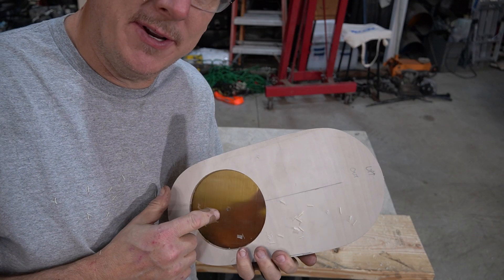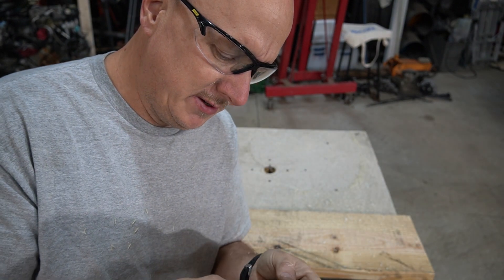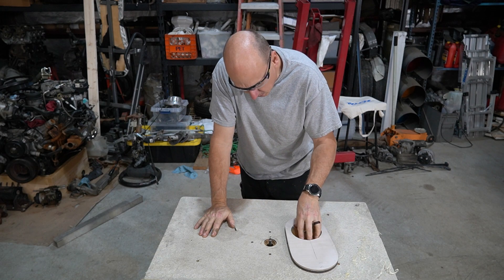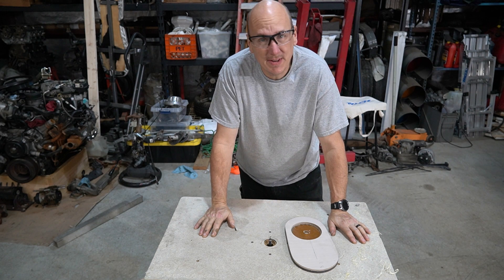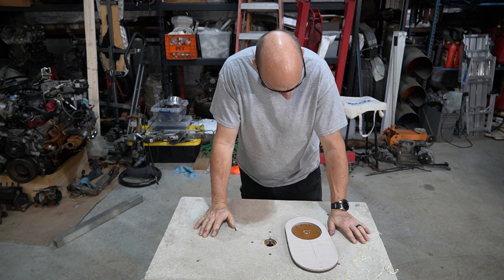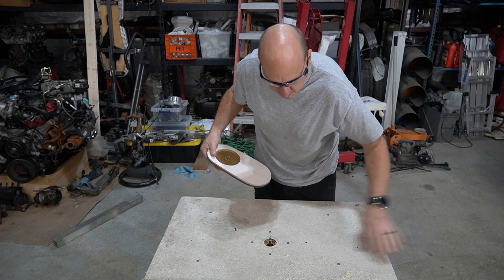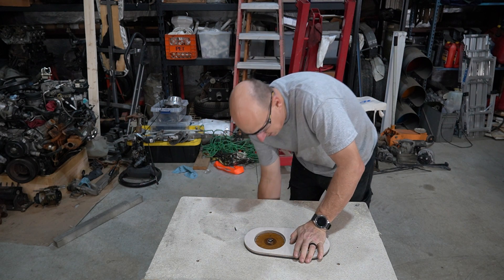Well, I'd say that worked pretty well. I had my doubts because cutting that plastic on the miter saw was a little bit tough, but it routed beautifully. I started with the hole saw to cut through it but it grabbed and just about jerked it right out of my hand, so I ended up drilling out the hole to three-quarters of an inch so I can get the router over the top of it and just route that hole out. The router cut this plastic so beautifully, so we're just going to let her have it.